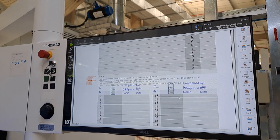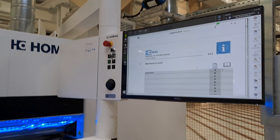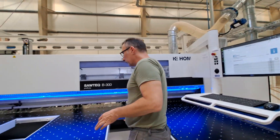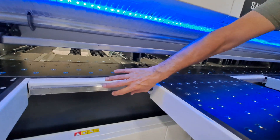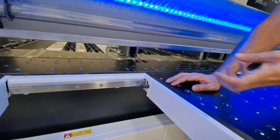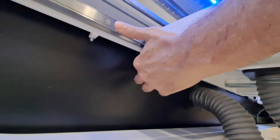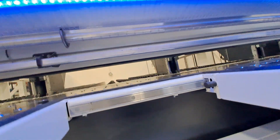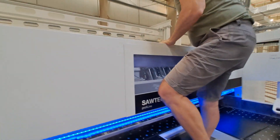I can point out some places you may lubricate twice. Everywhere we have linear guides — like rails on the linear guides — if you see such a rail, there is somewhere the slider. The slider is here below, and you have a greasing point here on the slider.